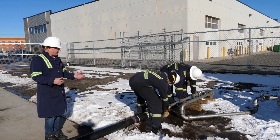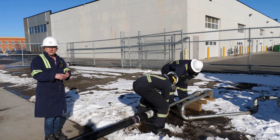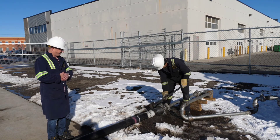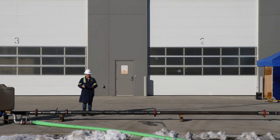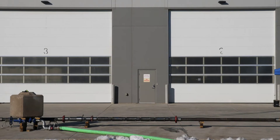What we should be seeing for the activation is the first five cluster sleeves sequentially open, followed by the landing sleeve opening — we'll see that open with a jet of water. In just a moment we'll begin pumping. The truck is set up to pump down through the fixture. The dart is going to activate and open the first, second, third, fourth, and fifth cluster sleeve, and then finally the sixth and final landing sleeve. I'm going to get out of the way here because we're going to get covered in water. The dart's getting launched right now and we should see our sleeves open in just a moment.